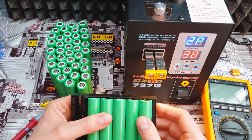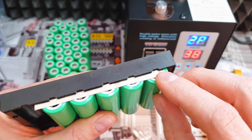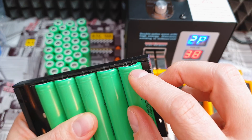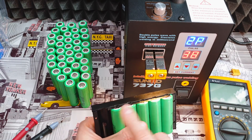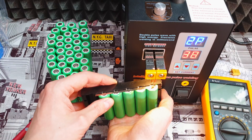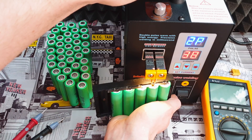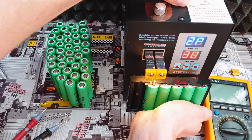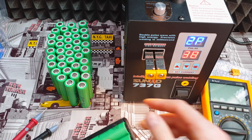Important: do every single battery one at a time, then go back — don't do multiple pulses at the same spot consecutively, because the spot welder heats up rapidly. After about four times at the same spot the battery can reach 60 degrees Celsius, and high temperature seriously damages the cells inside. I recommend six to eight welds per battery per top and bottom — that way you are sure the nickel will not pop out. Now let's do the bottom one as well.